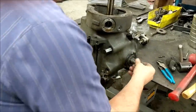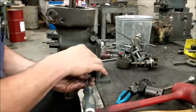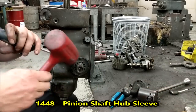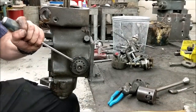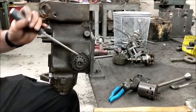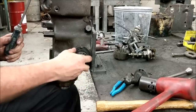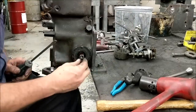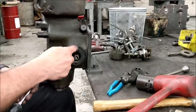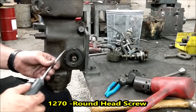Now you're going to remove your hub screw. Sometimes these come out really hard, sometimes easy — this one was barely in. There's the hub screw, and there's your hub. This one seems to be a little tight, so take the screwdriver. I do this side before I remove the set screw or snap ring because if this thing's tight, hold it in place. Got the hub out. There's a key right here. It's either a number five or a number seven depending on the setup you have. This one is supposed to have two screws in there to hold the clock spring in. Obviously this one is already missing one.